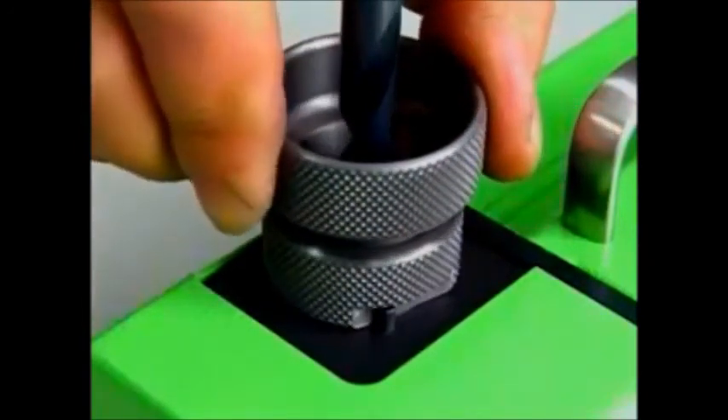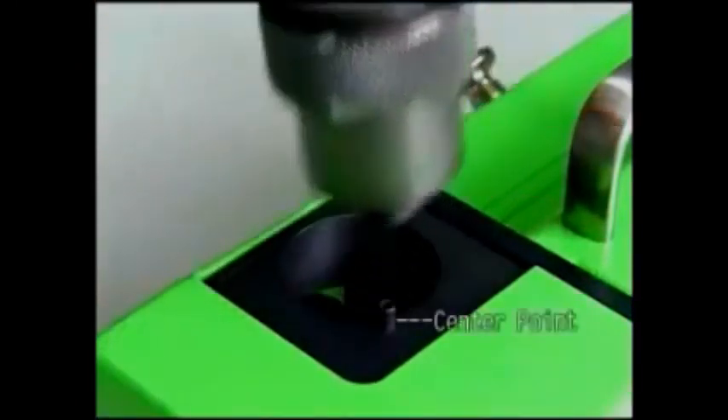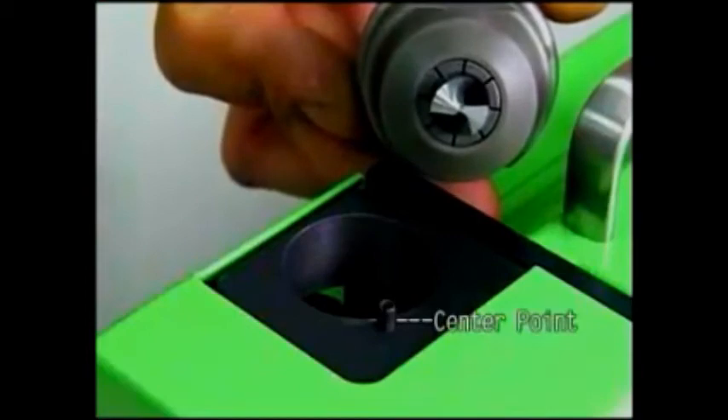For the web thinning application, to either insert or remove the drill, be sure the center point of the drill is parallel to the chuck set. If necessary, use a 0.1 millimeter or 0.3 millimeter pad beneath the center of the grinding shelf.